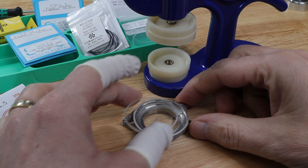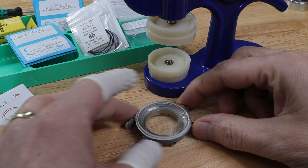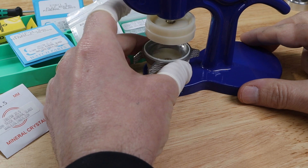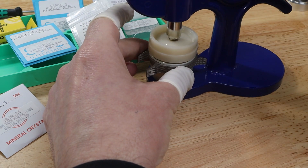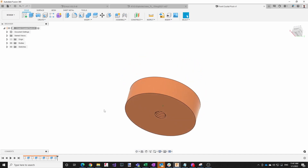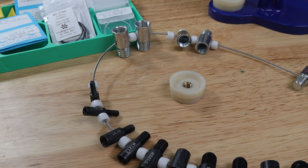The challenge I have is that when I put the watch case into this press to be able to press the crystal in place, it's hard to get it aligned exactly. And alignment is really important to be able to push the crystal in place. So I decided to make a replacement that is made out of aluminum because it's a lot softer than stainless steel. The idea is that it has a lip on it to retain the back of the case exactly in alignment.